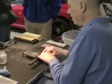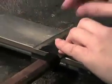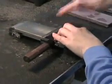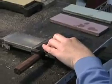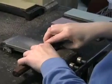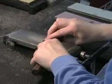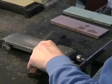lay the blade down flat, and if you hold it down on its side, and I don't care whether this is a polished blade or whatever, if you don't slide it side to side, this plate won't scratch it. Just hold it still. And you're going to feel a little bit of the edge sticking up, because the blade is now flat across on the blade face, and then it's going up this way towards the edge. So now I'm going to go forward until I just feel it click onto, and sometimes it helps to turn a little bit on angle, where that hollow ground,